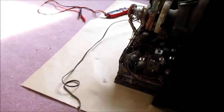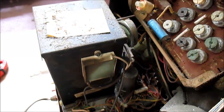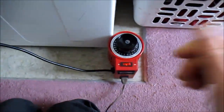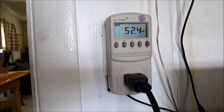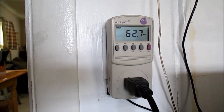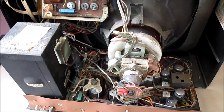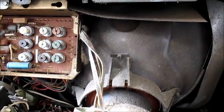I've been letting it bake at 40 volts. It's drawing about 20 watts and it's been steady — not a lot of power. Capacitors are still cool. It's been going for a few minutes now, so I'll inch up the voltage. It jumped up big time, then kind of fell back. I think some tube biasing must be starting here. Running at 80 volts now. I can hear the vertical oscillator running, the output's going, and I can even hear a little bit of crackling of high voltage.